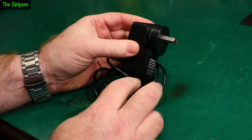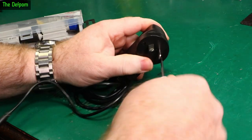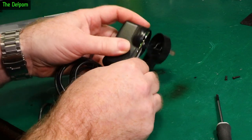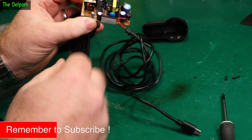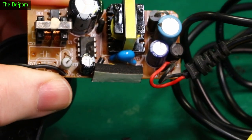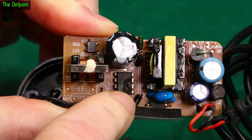A couple of screws — don't have to crack it open by the looks of it, so that's quite nice. Terminal's on there. This is dead. The chip has exploded. So I was going to use this thing and go, it's always a capacitor. Turns out today it's not — it's a chip which has died.